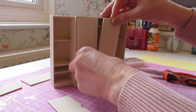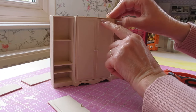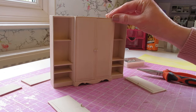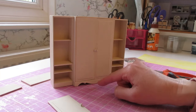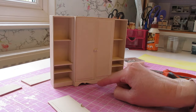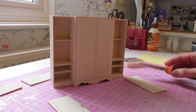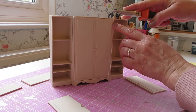Get the second one into place. As you probably know by now, I always like doors and drawers to be tighter rather than looser, and that is actually a really nice tight fit — I haven't got any gap down the center. If you ever find that something's gone wrong and you have got gapping down the center, you can put a strip in the center to hide the join. Some pieces of furniture do have a strip between the two doors, and I keep meaning to do a complete door tutorial as a one-off video.